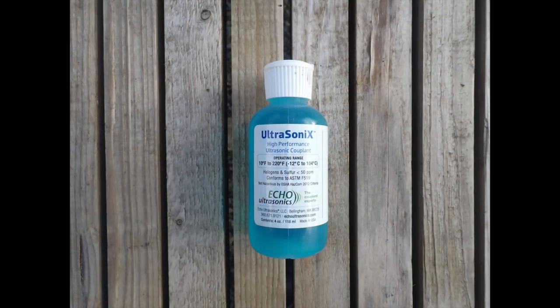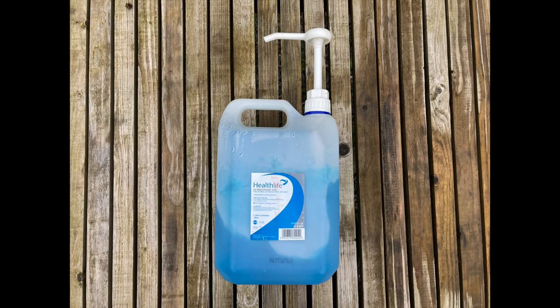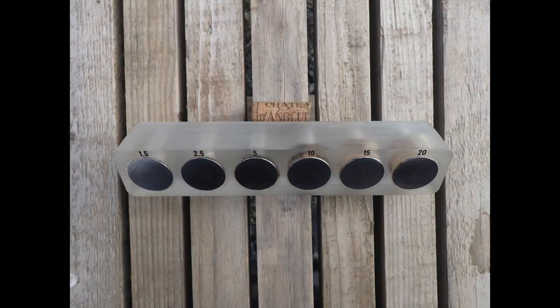I've put a link to both companies in the description below. To go with your meter you'll need a supply of couplant. You can buy specialist ultrasonic couplant from your meter supplier but I've found general purpose medical ultrasound gel to work just fine. You can get it in five litre jugs and if you add a pump dispenser then you have an easy resupply method when you finish your survey to top up the small bottles of couplant that come with your thickness meter. Your thickness meter should also come with a small steel test piece, typically 10 to 15 millimetres thick, to check and calibrate your meter before and after a thickness survey. I use the 3.5 megahertz 30 millimetre probe which is rated as good for 2 to 150 millimetres range. As mine came with a fairly chunky test piece I decided to enhance its capability and bought a set of six thickness test blocks ranging from 1.5 to 20mm.